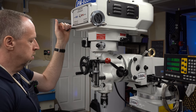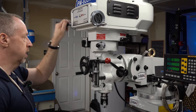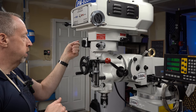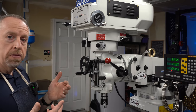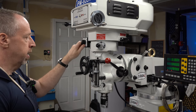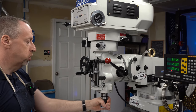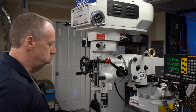There is also a brake lever up here, and it's in a little bit different position on different mills, but every mill like this is going to have a brake lever. On this mill, if I'm running forward and want to change direction, I have to actually stop it. Some mills you can just toggle directly from forward to reverse — I've used a three-phase Bridgeport that you could do that, which is great for power tapping. On this machine, you have to use the brake to stop it first, then go to reverse. The brake is also useful for immobilizing the tool when putting a wrench on the drawbar to change the tool — it holds it still and makes it easier.